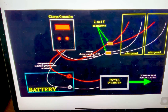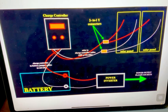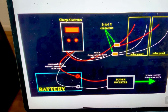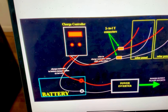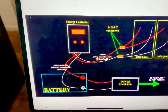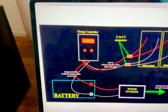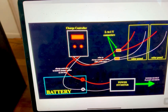Fundamentally you can get away with two items for an emergency: your power inverter and your battery. Not counting your cabling, that's either a pair of or more smaller solar panels, or one large solar panel — though the large ones become ungainly. I recommend easy-to-move 200-watt rigid solar panels. Whatever you do, don't buy flexible solar panels. Everybody will tell you the same thing — they have a lot of issues, durability problems, UV degradation, and on and on.